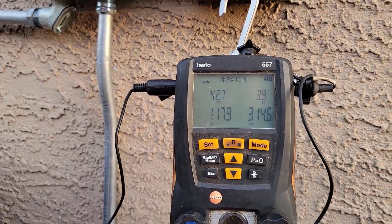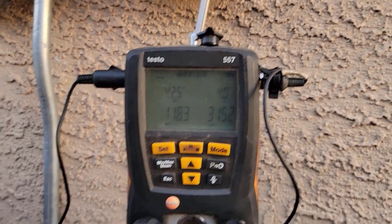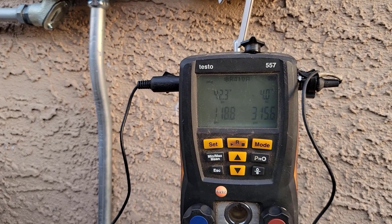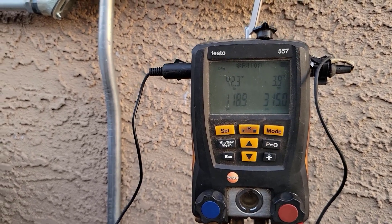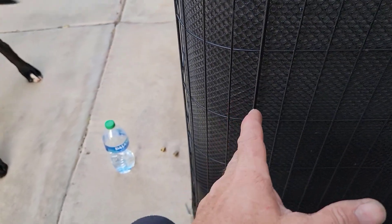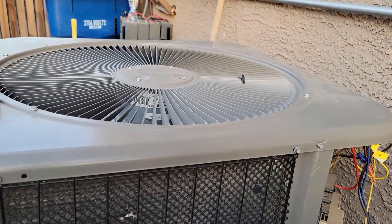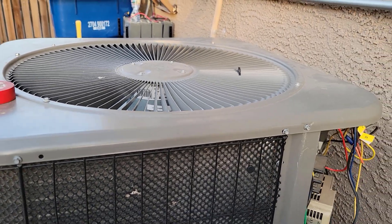Just waiting now to see - I had to add a little pinch of refrigerant. Sub-cooling is down about 3.9, superheat is still up about 42. Normally you'd just start adding refrigerant here, but with these newer efficiency units with expansion valves, on a high load you want to hold off because it's probably flooding a little more than it will when it comes down to temperature - then you'll stack up a little more refrigerant in the condenser. It probably has lost a pinch because I took the refrigerant from this unit with my recovery machine and purged it, then moved the refrigerant from this into the carrier tall boy, and when that wasn't going to work I moved the refrigerant back. So I'm sure I've got to add a half pound or so.